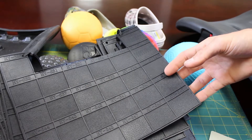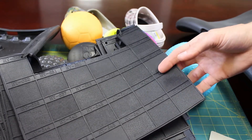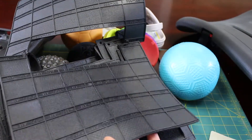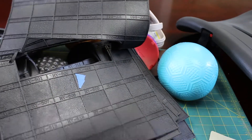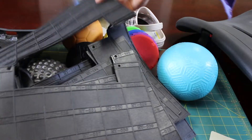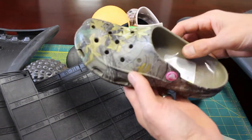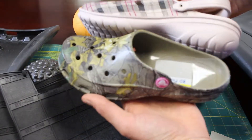Because pop foam is an injection molded EVA foam, all the rules of molding and textures apply. You can have limitless different textures molded into the product, basically to your heart's content. Also, the material is fantastic when it comes to 3D applications of graphics — you can do either dipped or printed applications of graphics.